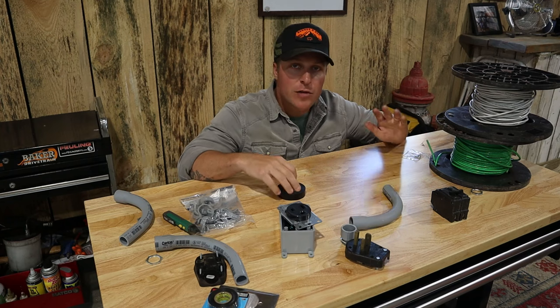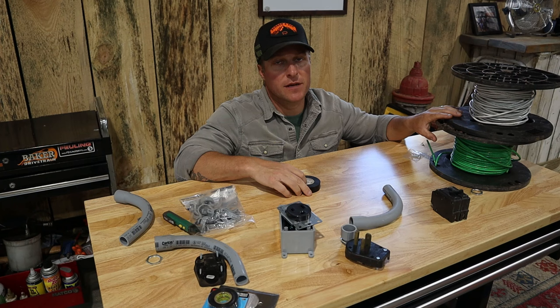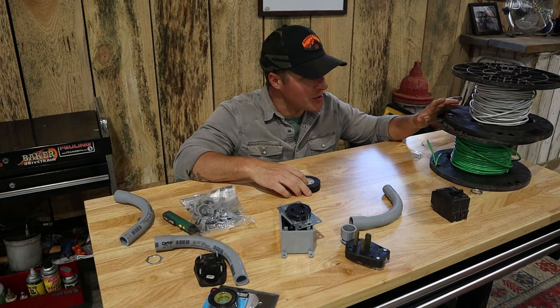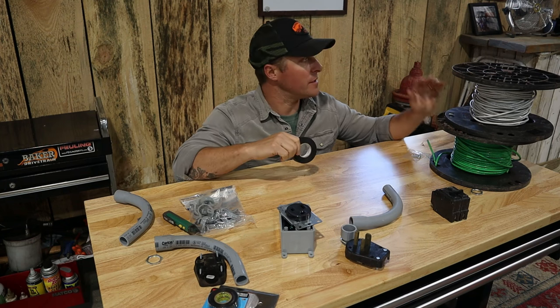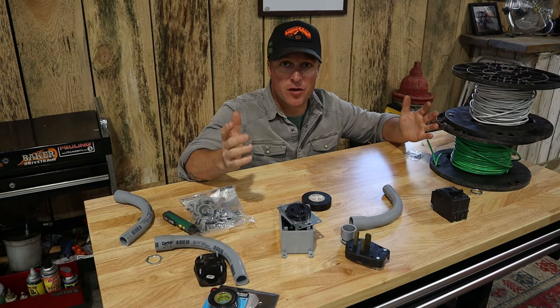They do have these collars that will accept this PVC pipe perfectly above your panel box. We will secure the conduit to the walls and ceiling with these half-circle rings. Once all the conduit is secured we will suck a string through so we can pull our wire through to its location. We are using eight gauge copper stranded wire — white and green. I'll label it accordingly. The reason I don't have black is because this was left over from our well pump job and this stuff is so expensive right now, so I have it for free. I will label the hots accordingly with electrical tape at the box and at the landing location.